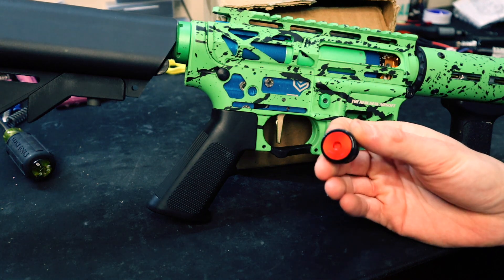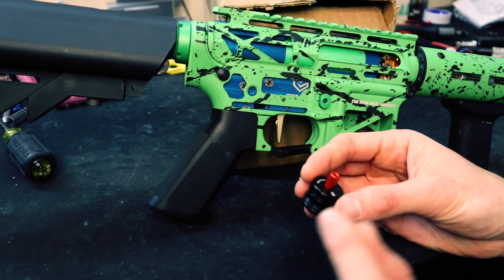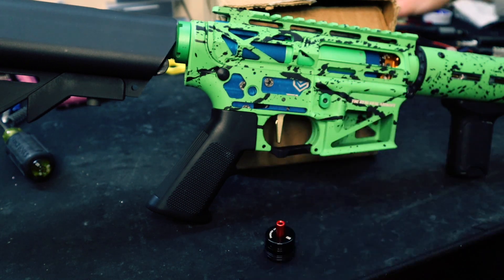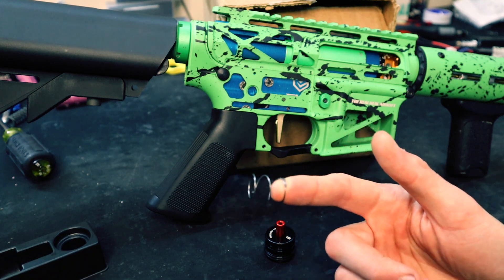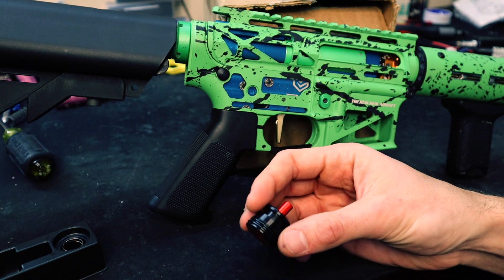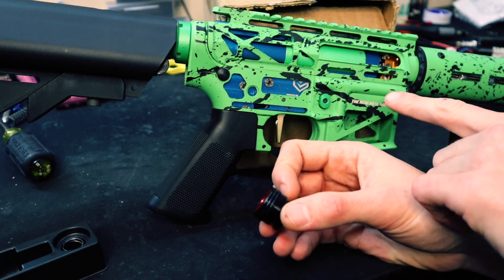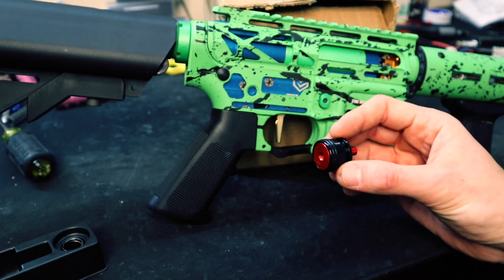Before we install this part, I'm going to take it apart and show you what it looks like on the inside, and give you a recommendation on how to disassemble it — I found a very easy and quick way. Something else to note: I changed something inside here compared to the first video. I swapped out the spring for a softer one and lubricated the internal o-rings.